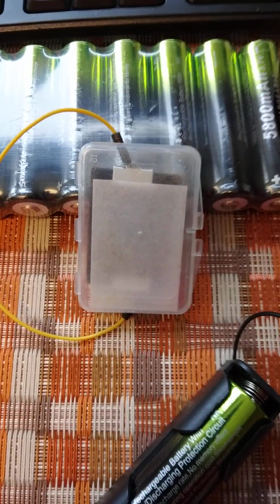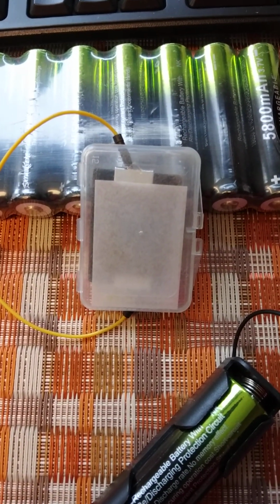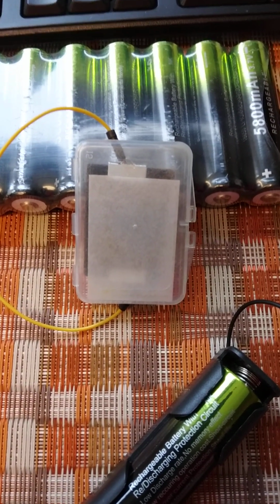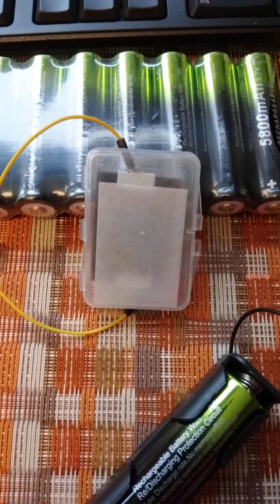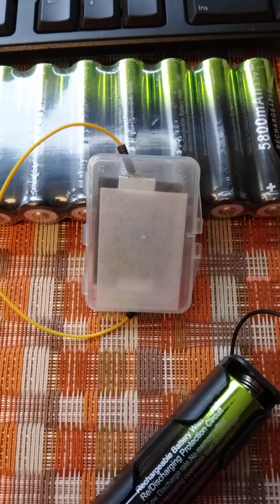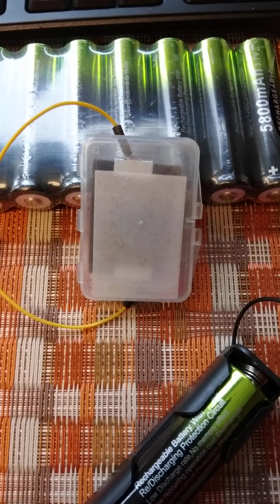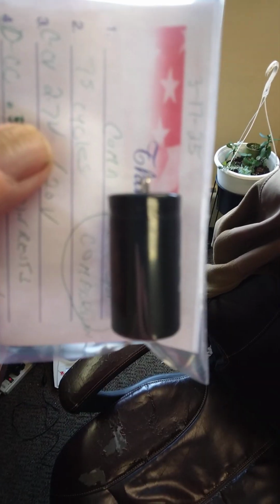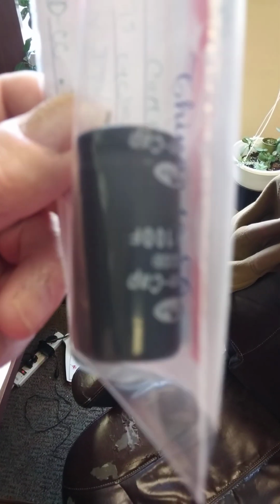And we're demonstrating that the supercaps, now the ones with water, are going to stay at about 1.1 volts because you don't want electrolysis of water occurring. With organic solvents like DMF or the carbonates, the carbonate esters, in industry they put them out at 2.7 volts. They're worried about flammability, leakage, explosions, fires, and rightfully so. Here's a typical commercial supercap we use, about 2.7 volts. This has a capacitance of 100 farads, which is very good for estimating capacitance after runs.